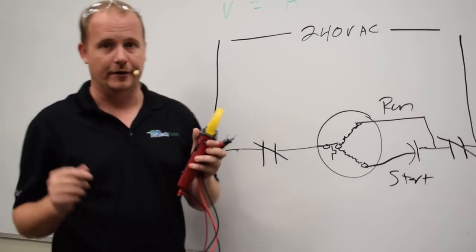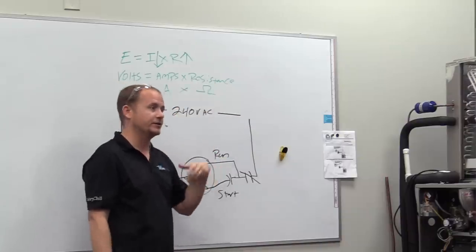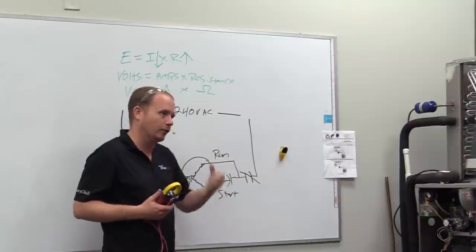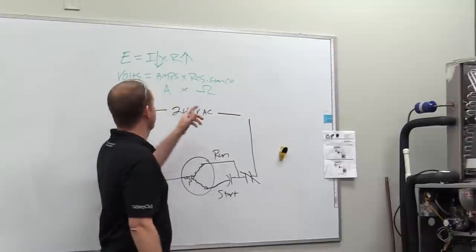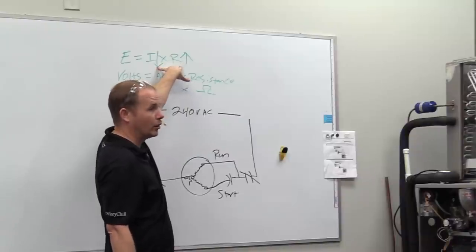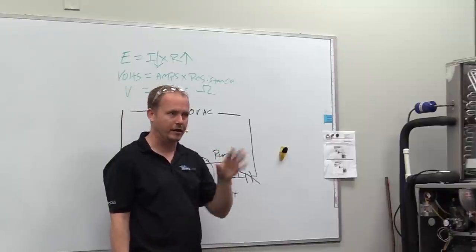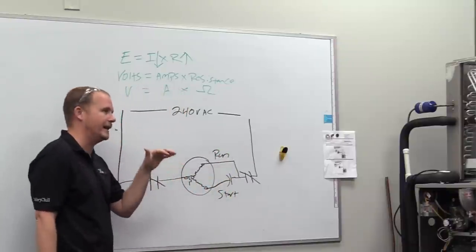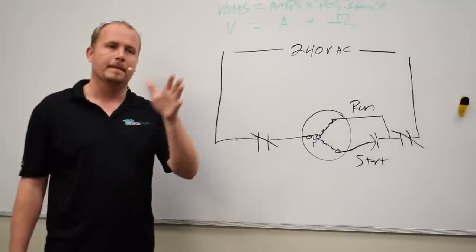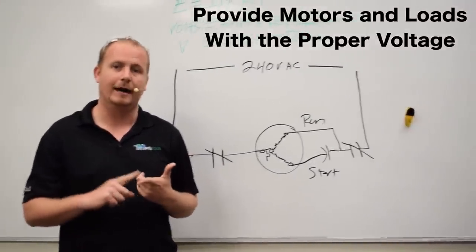But the other side here that I always like to mention, because a lot of people get confused, is that physical resistance is inverse to electrical resistance in a motor, which is why when you lock a motor or grab a ceiling fan, the amperage goes up because the resistance is coming down, because resistance and amperage are also inverse so long as the voltage stays the same. So that's for maybe a little bit more nerdy viewer there. There's some things that if you don't understand them correctly, you're actually going to come to the opposite conclusion of what you should.